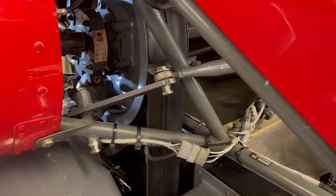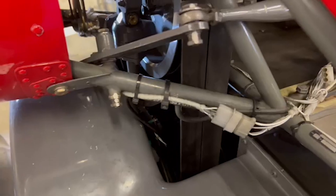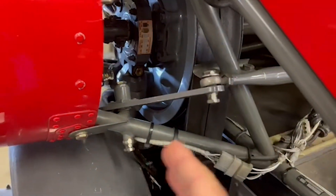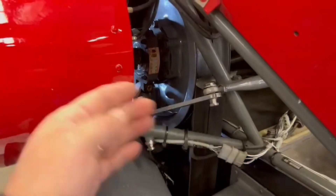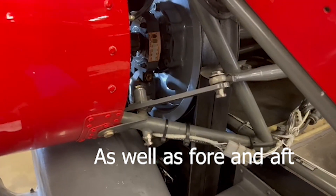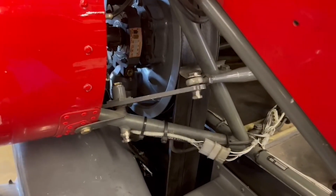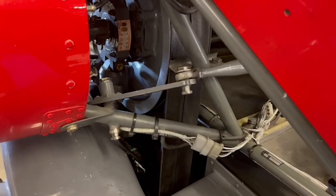The thing you're shooting for is to get the two sheaves - the upper and the lower - in alignment towards the front and the back, so those two are lined up and one isn't out of alignment with the other. The sheave itself also needs to be in the correct position left to right. That takes quite a bit of finagling - a lot of it ends up being trial and error. You have to change the shims, check the alignment again, and if they're not quite where you want, you start over and change shims once again.